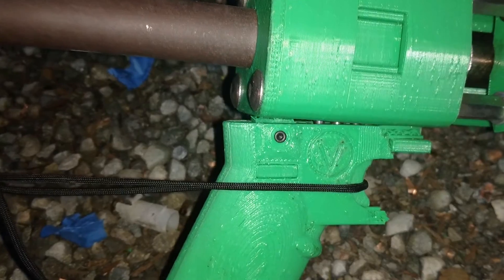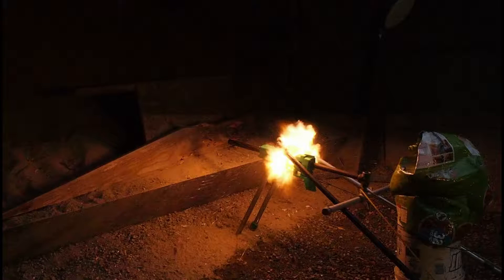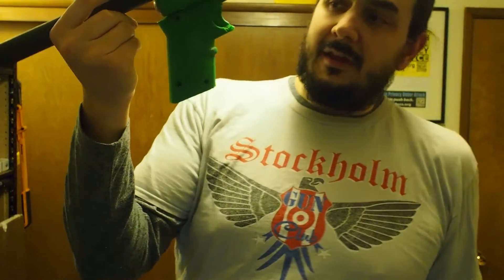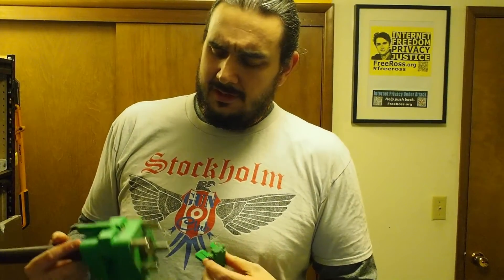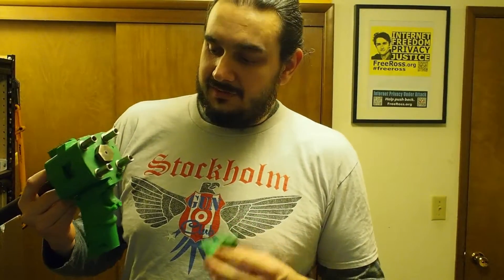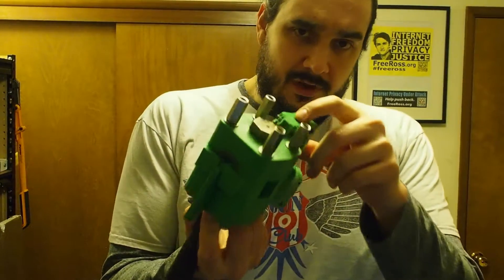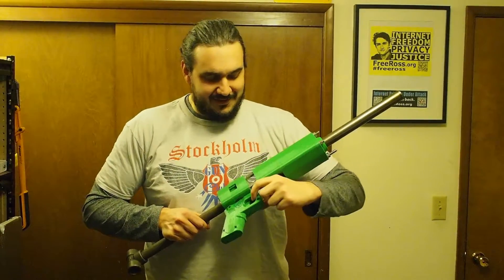Even though the lugs are not solid — they're printed at 25% infill — it's supposed to go on right there and we basically ripped it off. That happened for a couple of reasons. One, we were firing 3D printed rounds — you would call it case head separation if it was a brass round, but it doesn't really apply because it's plastic and they just shatter, they turn into a lot of little bits. That was eroding away at the top of the trigger guard here, and eventually it just failed — it didn't have the strength to stay holding on and it yanked the front end of the trigger guard off.